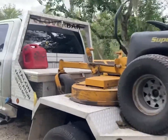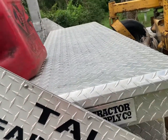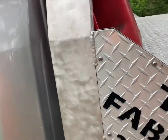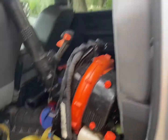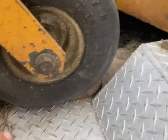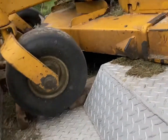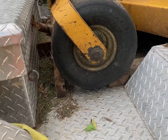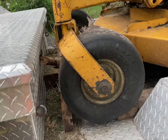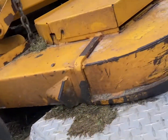That's easy enough. With this truck being big enough, I can easily carry the big backpack blower and everything. I'll put the string trimmer in there too, and this time of year with rain and leaves, the backpack blower becomes really beneficial. I built a little pallet that has some wood stops connected to those boards in the middle. What that does is give a little place for the front wheels to drop down into, and then when I pull forward with the ratchet strap, it sucks the mower down against that board.